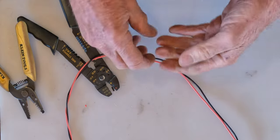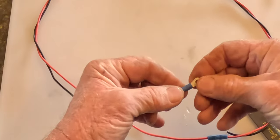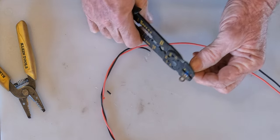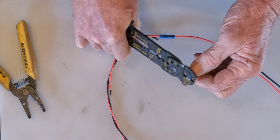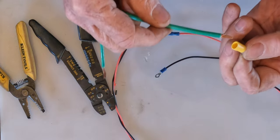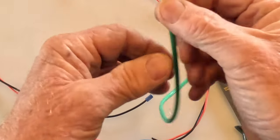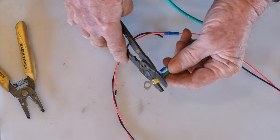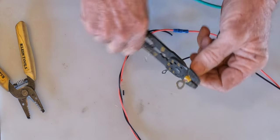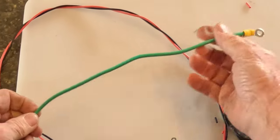On terminals, we have a variety of terminals that we can use. Here's a blue one, and I have a yellow one here. This is a number 10 stranded wire — it twists in there and it's a yellow terminal. The yellow is the bigger one. Get a good crimp on that, so that is your number 10 wire crimp when you're making up to a terminal.